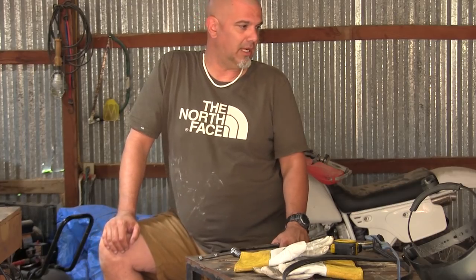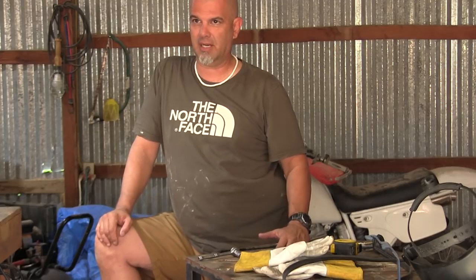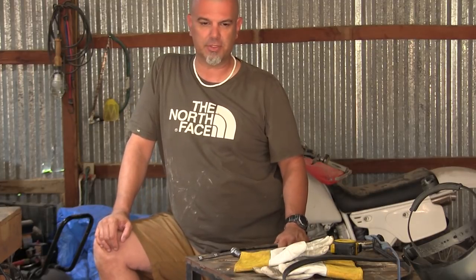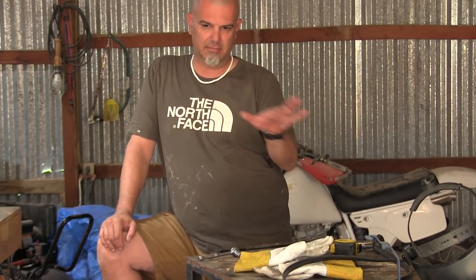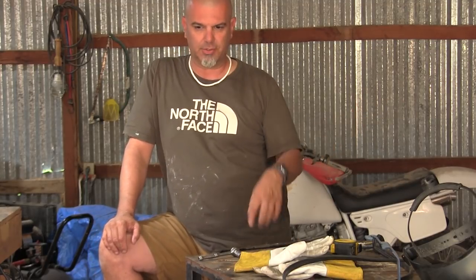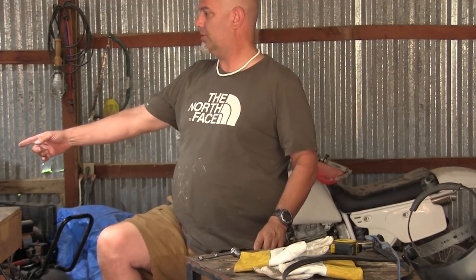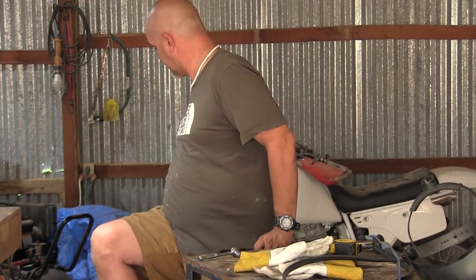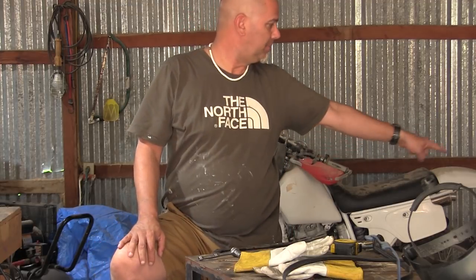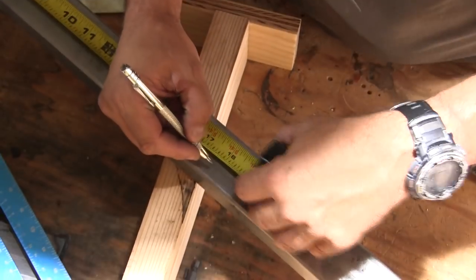When we mount it up there, if it's not square, then the wood we put on here isn't going to match up. And then we're going to have a whole bunch of problems with meeting the seams and the supports where we're going to screw this down. We'll measure it out where it's good and square. I will cut two supports and put them in the corner across there, holding this thing square. If we put a diagonal in, then it can't move again. 18 inches.